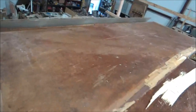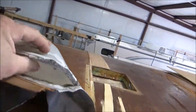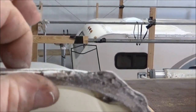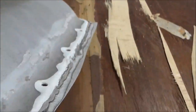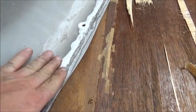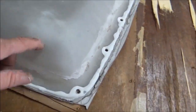We've got it right here. Here's a lid that we took off. Look at this lid — there's no flange to it, so it's really hard to seal. You can't really seal that. They just wadded up butyl, but it's really thin right here where you don't have enough flange to put any butyl or anything to seal it out properly. So what they do is put these screws in at kind of an angle — that isn't really a good flange enough to get it to seat properly. And these always leak. Every time they come in the shop, we have to replace these lids.